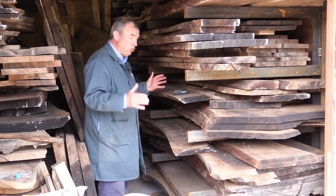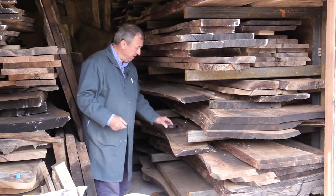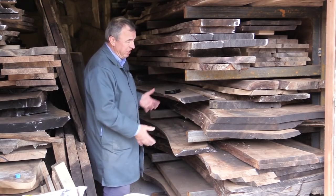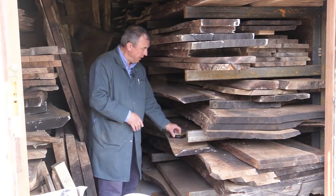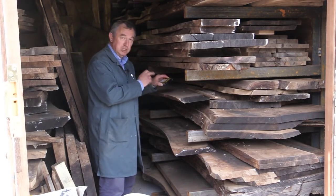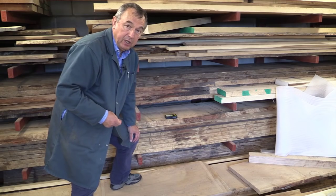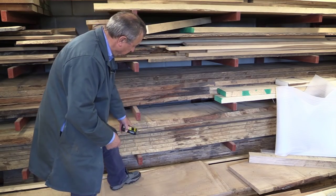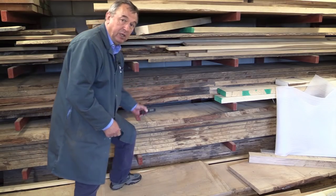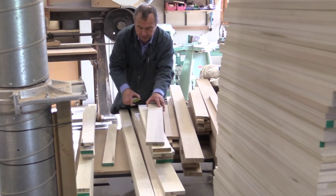I'm here in my friend's drawing room — I've opened the doors, he'll probably be very cross with me. You can see the utility of one of these meters. This is English walnut, absolutely beautiful — I'm very jealous. You can very quickly check how each individual board is doing. This is penetrating quite well down into these thick lumps of wood. This is the storage area, the final stage prior to wood going into the machine shop. You would do a final check here before taking out bits that had been stickered up for quite some time, just to be sure.